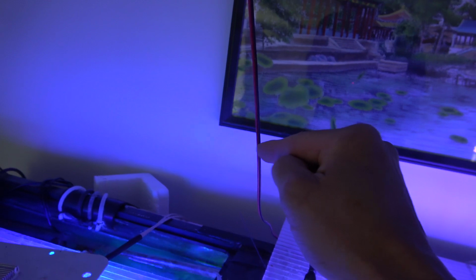And also when I cut it, those little end wires that are left wild there could be touching each other before I have a chance to put everything down and get to it. So what I want to do is just take a knife and cut down in between the wires, separate them and cut each one separately. Now you definitely don't want to mess with AC like this, but with DC, I don't really have a problem with it as long as I keep them separate and don't touch them. That being said, I could probably just cut it and I'd be fine, but I'm gonna go ahead and separate them, be safe. Now we're live off the solar panel and as long as I don't touch this one to that one, I'm pretty good.